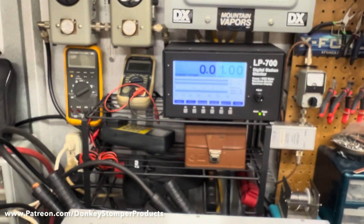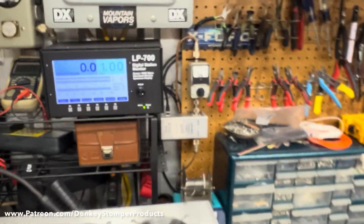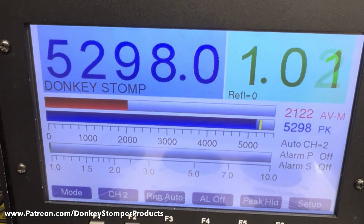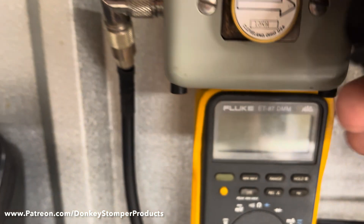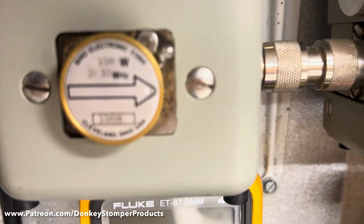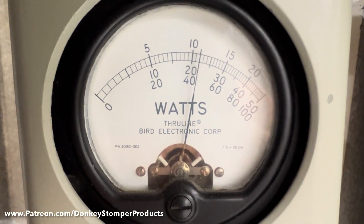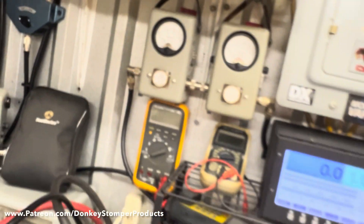I'd run it about to 3,500. If I've got it on the antenna and it's at 3,500, I wouldn't worry about it — you've got 2,400-watt pills. One more time keying — about 4,400 on the bird. So I'm happy with that. That's as hard as I'm driving it. I know a lot of people drive harder on videos, but she's working.